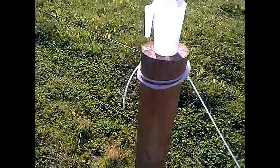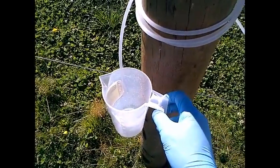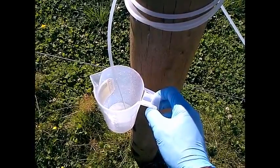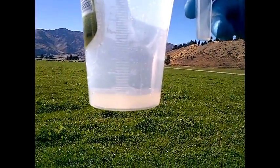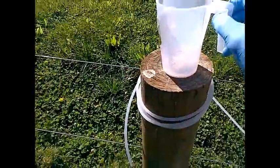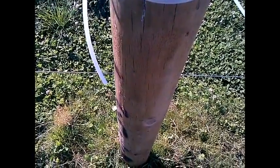The pump will pump a maximum of 29 milliliters per cycle, and we're getting about 20 to 25 milliliters per cycle. With the current setup we're looking at about two cycles a minute, and you can hear the pump cycling.